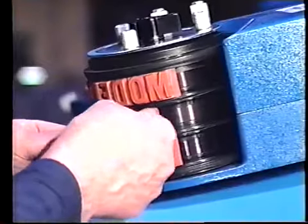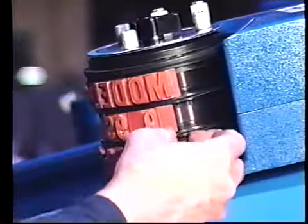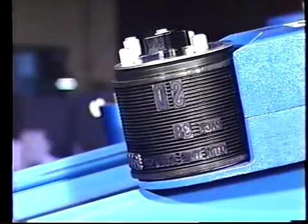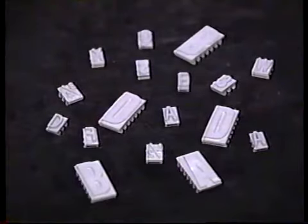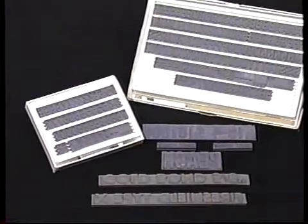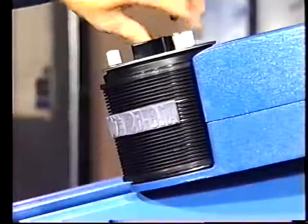Individual characters should be blocked in with rubber type blanks furnished. Blanks are also used as spacers. Base lock type is recommended for printing character height less than 3/8 inch or when message lines are staggered. Base lock is available in individual characters, logos, and stock box assortments of number or letter sets. Type is inserted into loosened base lock rings and is locked securely by retightening the rings.